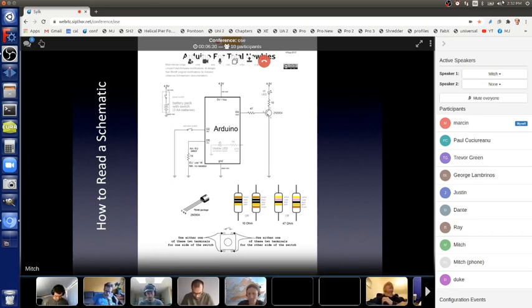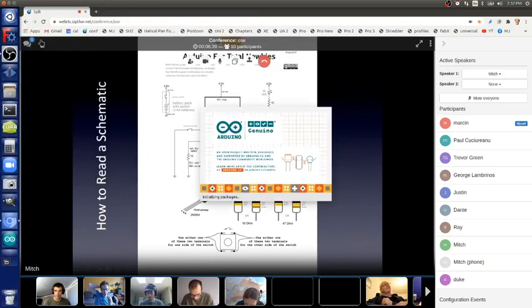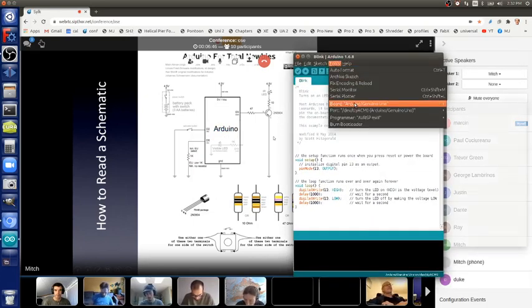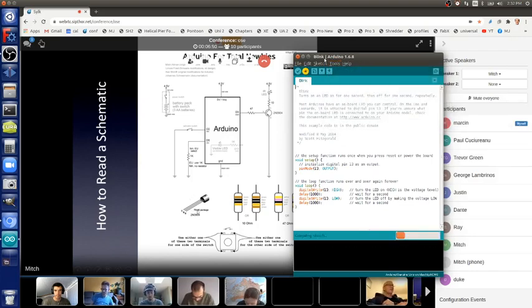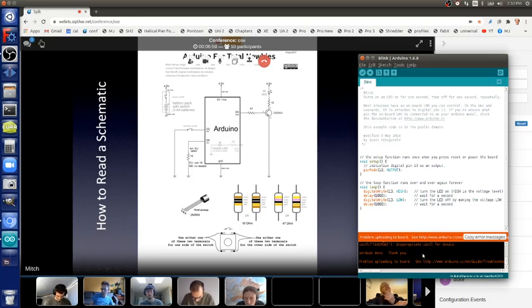Okay, and then this part, which I've never said what it was, is a transistor. And its name is 2N3904. If you look online with 2N3904 in your favorite search engine plus data sheet, you get a data sheet with lots and lots of really interesting information that if you don't know electronics, you won't understand. But it'll show this picture, which shows you which of the three leads is C, B, and E. And that again stands for collector, base, and emitter.